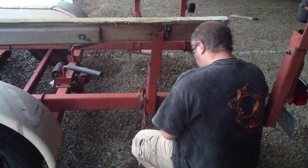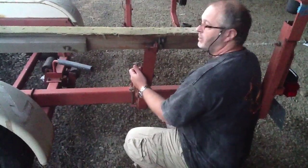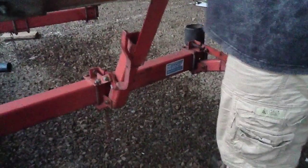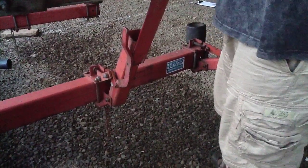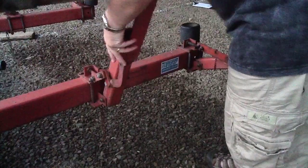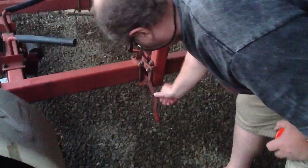And these little doohickeys right here allow you to kick it out when you're going to put the boat on. So you widen these out, and then the boat can just snug right in there. And then as soon as you pull it out of the water, you hook it up at the nose, right? And then when you're going to trailer, you kick these in. It puts pressure all the way along the whole side of the boat and keeps it nice and snug. And then there's these chains that hook on here to keep it from going anywhere, right?